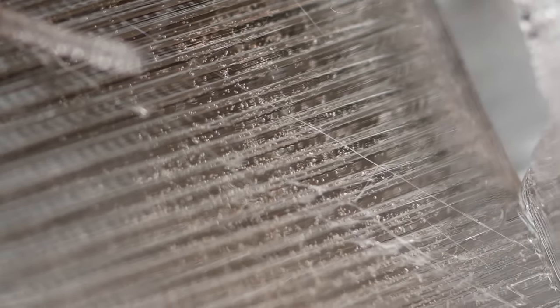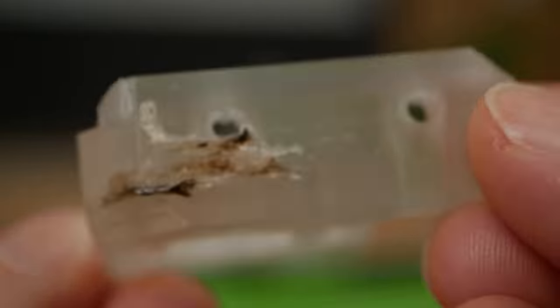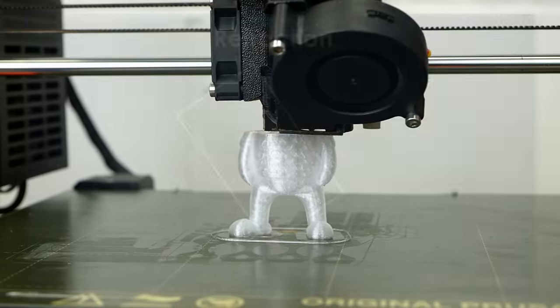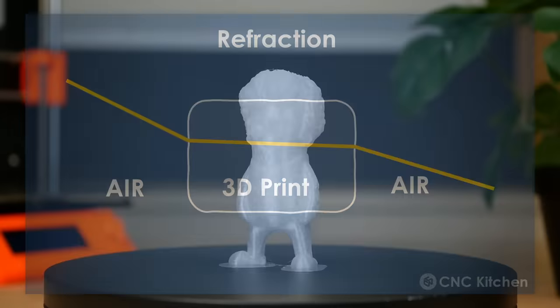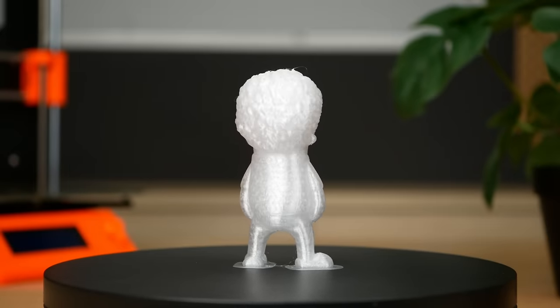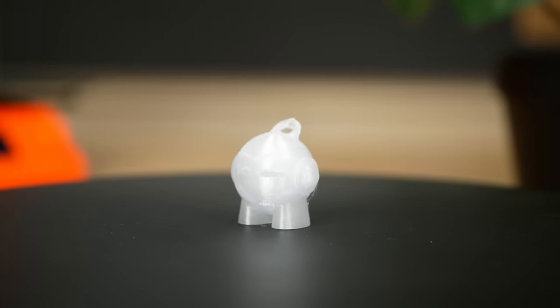Keep in mind that besides the bubbling, materials will degenerate if they are too hot for too long, which I also saw on some parts due to their brownish hue. Let's talk about why regular prints with transparent material are not as transparent as glass. Light refracts when it moves from one medium to another, bending depending on the materials and inclination angle — in our case, air and PETG. A regular print is not solid material, so the light passes through dozens of these interfaces where it refracts, diffracts, and reflects in a completely irregular way, meaning parts appear shining white rather than translucent. Even with 100% infill, there are still tons of voids where refraction happens — gaps between extrusions and interfaces between individual extrusions where the polymer is not properly melted together, which also makes parts appear milky.